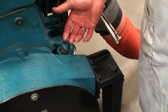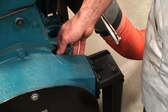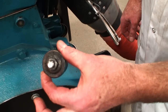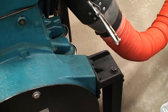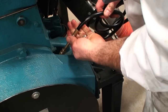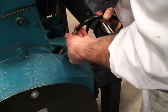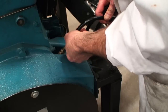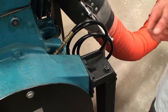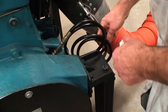I've loosened off this fitting because we need to hook up an engine oil pressure gauge. This fitting goes directly into the main rifle gallery, which is the volume supply gallery for the engine. This is the sensor that would normally be in that position. What I'm going to do now is install an engine oil pressure gauge into that area so I can monitor the engine oil pressure during running and report the low idle and high idle settings. We'll snug that up and tighten it with a wrench so that we don't have any leaks.